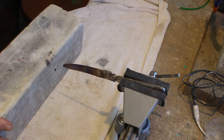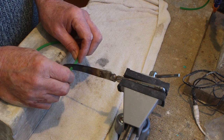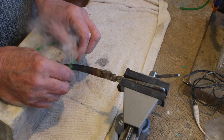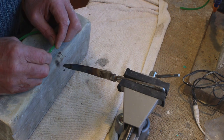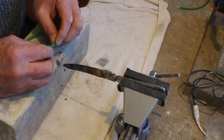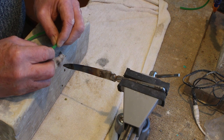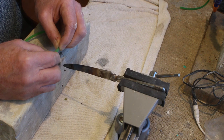Turn off the blowtorch and put it to one side. Hold the poly belt on either side of the blade, letting it warm up very close to the blade — it's quite hot and it's starting to melt. Then touch the two ends together, pull upward off the blade, and press them together. You have a few seconds to move and straighten the joint, but then hold it steady and keep pressing for at least one to two minutes, as it takes a surprisingly long time for the plastic to cool and fuse in the core of the belt.